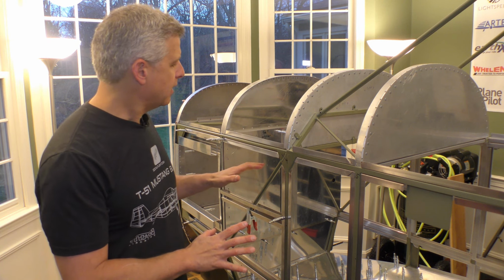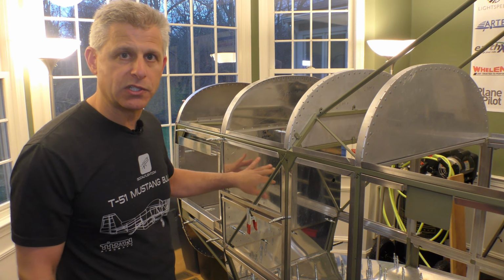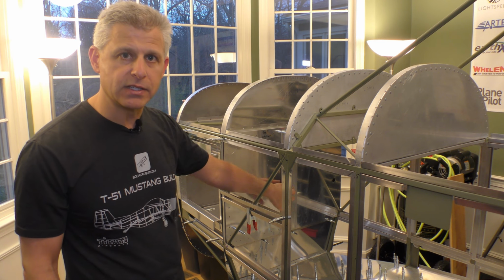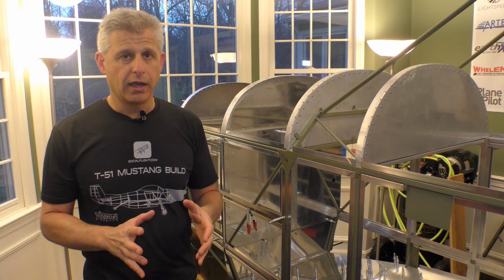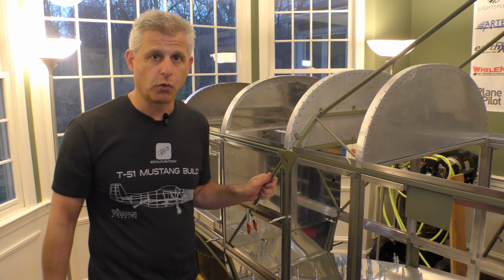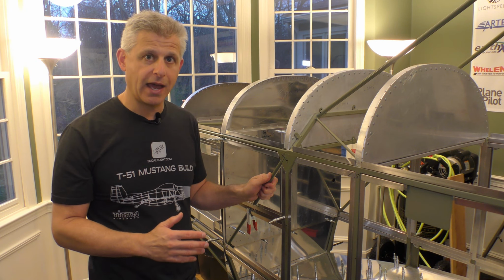Now, in the cockpit, they have a very interesting design. We talked before about this Station 3 bulkhead, which is an extremely strong structure, and it has this reinforced piece here in the center, which is our main rudder control support. Now what we're going to do is put the sides of the forward cockpit in, and also the structure that's going to make these rudder pedals happen.